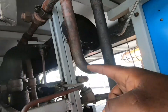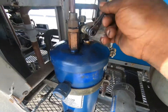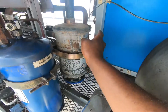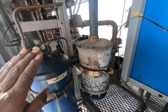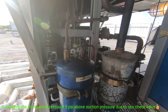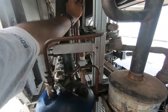Down here at the bottom going right here at the top, let's go ahead and valve this down. This is the equalizer line. Basically you have the discharge pressure coming through there at 250 psi - it comes through here putting that pressure in. This is higher pressure than the suction, and what happens is it takes that excess pressure and sends it right here, relieving it back into the suction line, keeping five psi in the vessel so we can feed oil. Let's go ahead and valve this off.